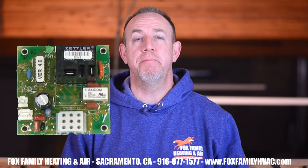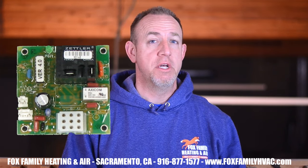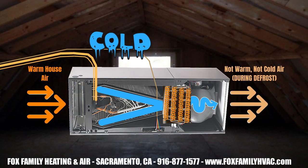When those two requirements have been met, a contact on the defrost board closes, completing a circuit to read 24 volts at X2 so that the heat strips on the air handler will come on. Inside at the air handler, the fan still blows, which means there's cold air coming out of the ducts, but the air handler's heat strips come on to neutralize that cold air.